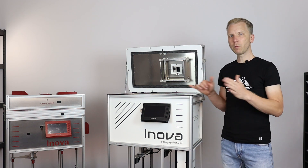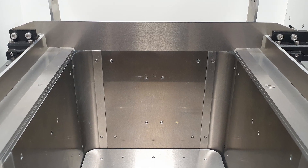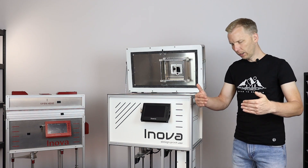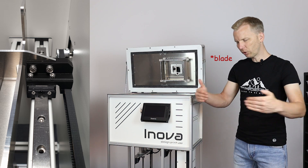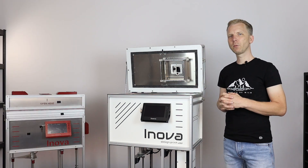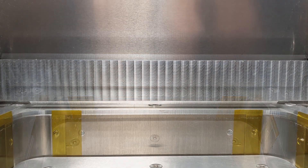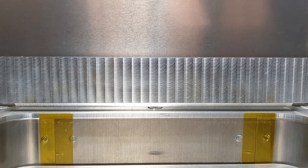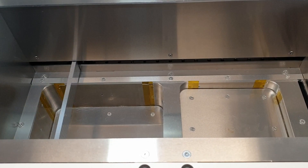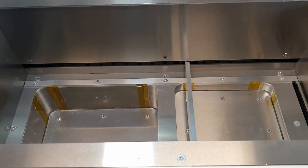In the first prototype the blade was made from three-millimeter-thick aluminum, which worked quite well, but I had big problems with vibrations because the blade is connected to the belt on only one side of the linear guides. Pulling the belt on one side caused the blade to vibrate since it was not rigid enough, and that affected the quality of the layer. So I decided to make the blade thicker — now it is approximately eight-millimeter-thick aluminum. I also changed the bottom shape of the blade slightly to achieve better surface quality of the recoated layer. This sorted out all my vibration problems because the blade itself now also acts as a stiff gantry between the linear rails.